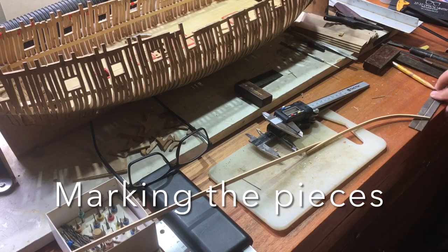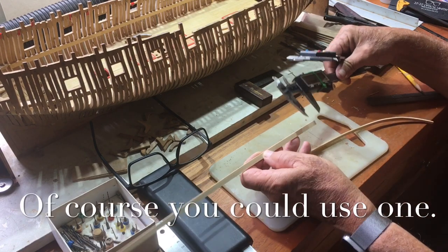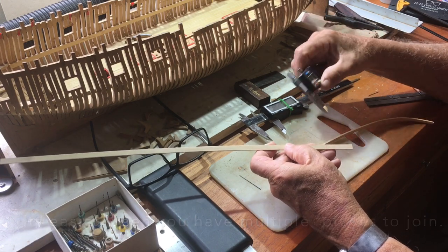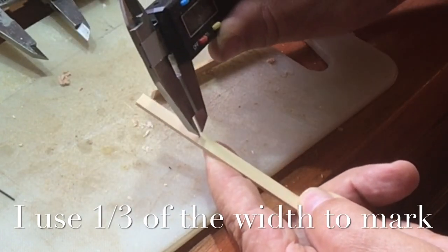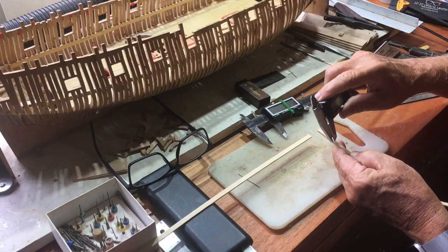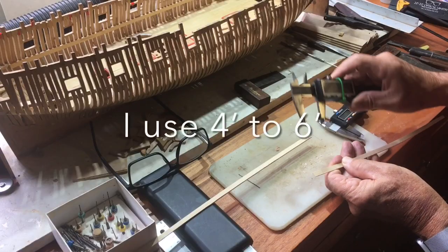There are very few tools you need. I suggest two calipers or two tools that can mark the piece — one that determines the length of the scarf joint, and the other one that determines the actual top and bottom side of the joint. All you do is take the caliper and mark on both sides, and do the same thing on the other piece. Make them the same length, so you determine the length that you want to make the joint.